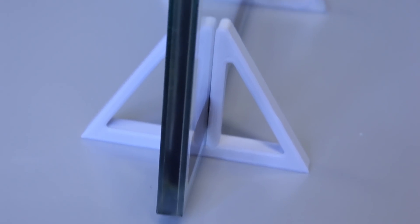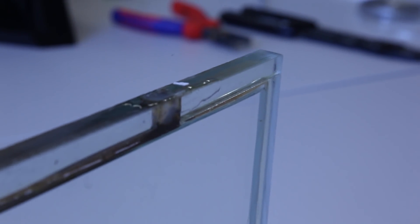But we won't remake anything until we have the whole display working. Anyway, the tank is made from a pair of 2mm glass plates that are separated with a 6mm glass frame along the edges. They're glued together with epoxy, and this is generally not considered to be a very good design for a ferrofluid tank, because the flat glass and the introduction of epoxy increases the rate at which the ferrofluid degrades compared to, for example, a custom-blown glass tank in one whole piece. But the visual expression that we want means that we just have to accept this flaw and expect the ferrofluid to degrade faster.